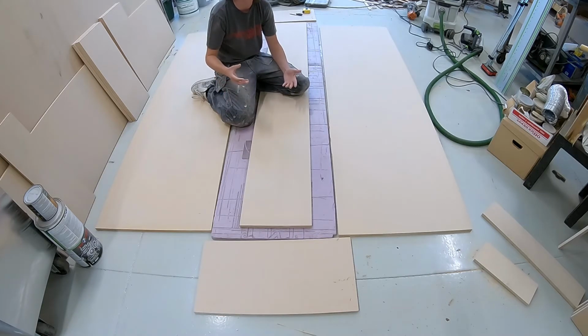And it doesn't really necessarily matter what the thickness is that you're cutting. Really thin stuff, although light, becomes very flexible, and so it can be hard to control. And so my preference for the larger sheet goods, unless you have a really large sliding table saw, would be to cut it on the ground or on sawhorses or something like that with a track saw. And with that, you can get very, very accurate results. Everything is nice and square and perfectly cut, and you can get the same or better finish than you can on a table saw. But it's a much safer way to do it. You know, you're not throwing your back out doing it, and that sort of thing.